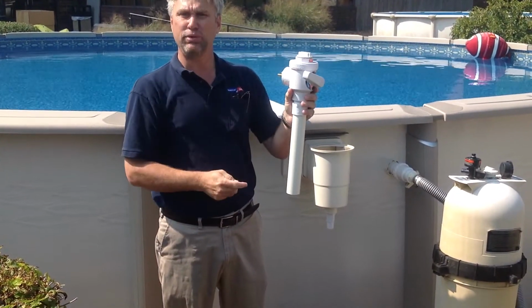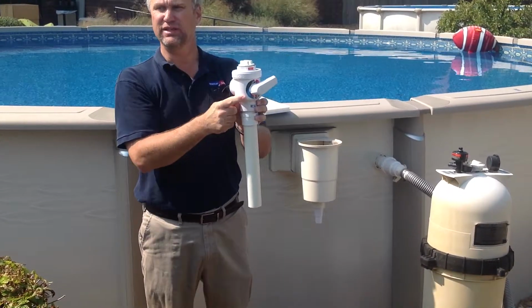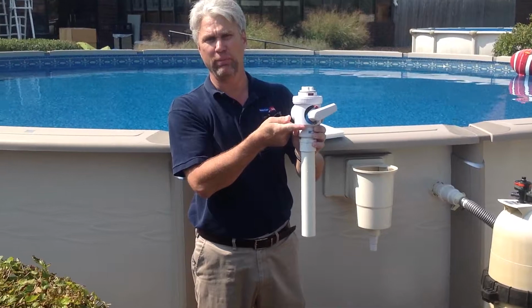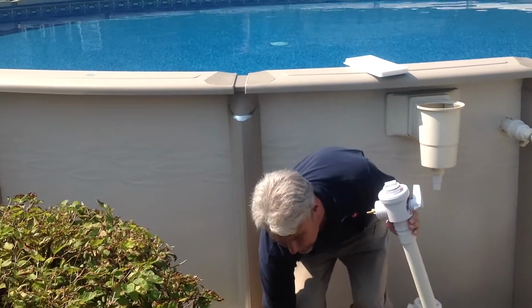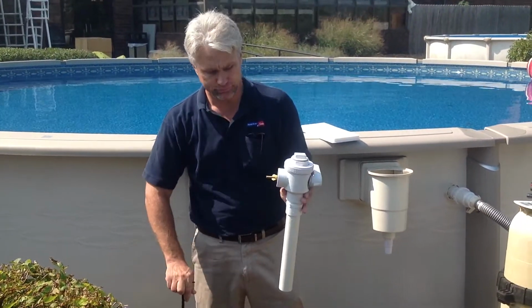With both fittings in place, turn your valve back to the full position. This is pointed again towards the bottom, which allows all water coming up from the main drain. The fittings will prevent any water loss. The next step would be to use a bicycle pump, compressor, or anything you have that will pump air through this valve.